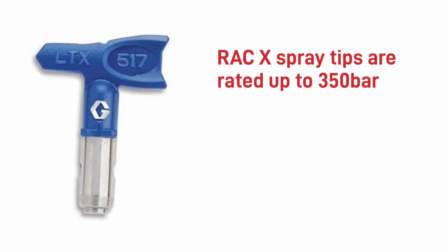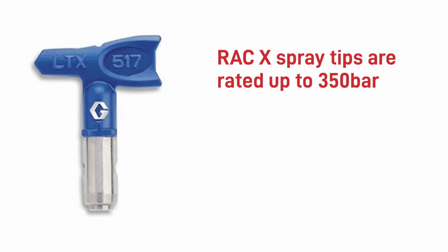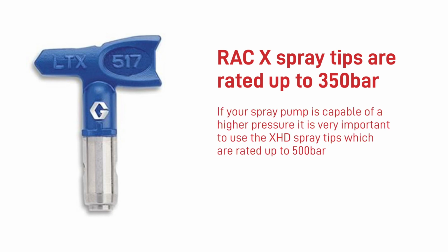Size the spray tip according to the tip rating of your sprayer and make sure the sprayer can support the tip you are planning to use. The RAC-X spray tips are rated up to 350 bar. If your spray pump is capable of a higher pressure, it is very important to use the XHD spray tips, which are rated up to 500 bar.